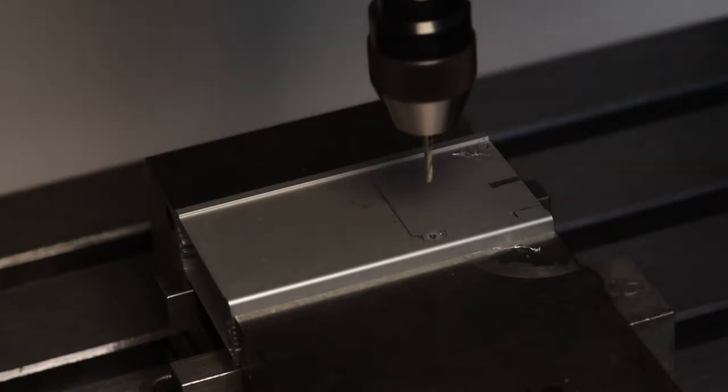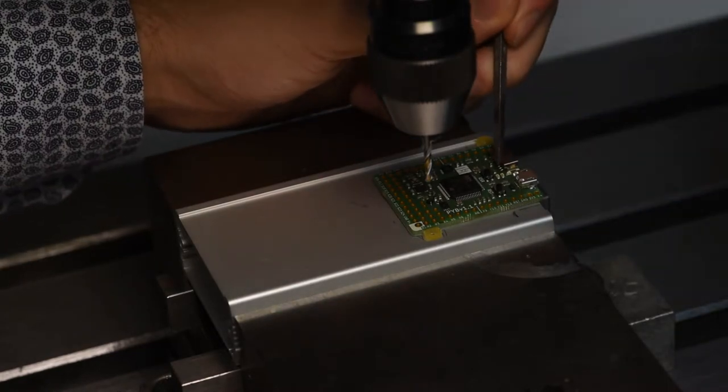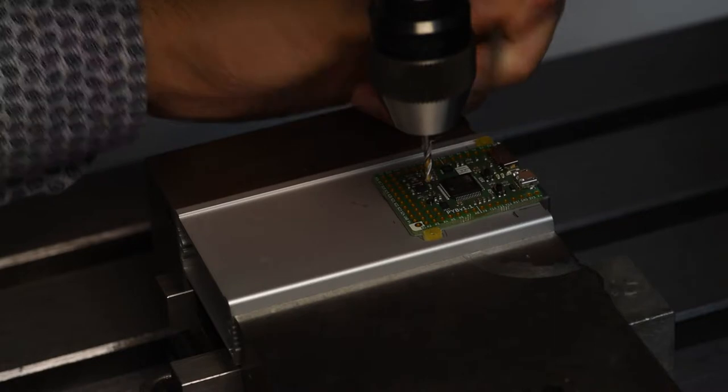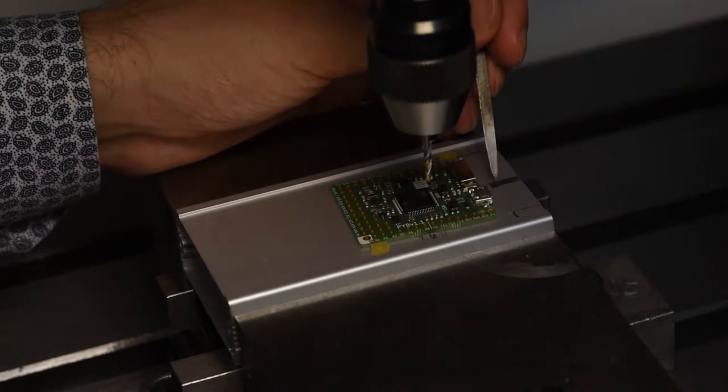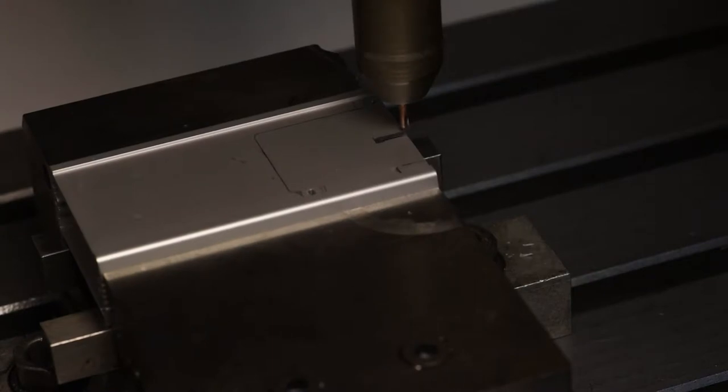And as soon as that is done and we know exactly where the pyboard will be placed in the end, simply because now we have the attachment points defined, we can again place the pyboard on top of the aluminium body and make sure that the rest of the holes which we drill correspond exactly to the features which we need to see and access. First off comes the LED slit, which we ascertain is indeed correctly marked given the fixed position of the pyboard.